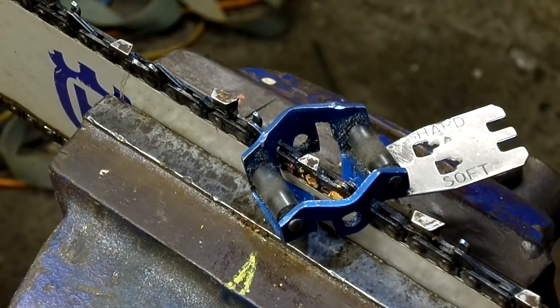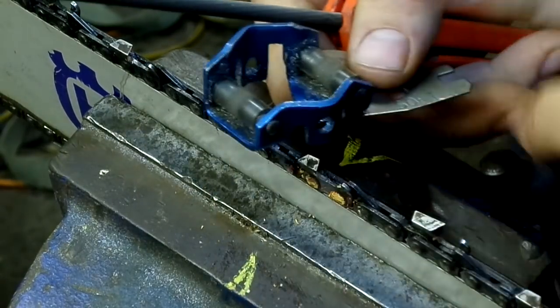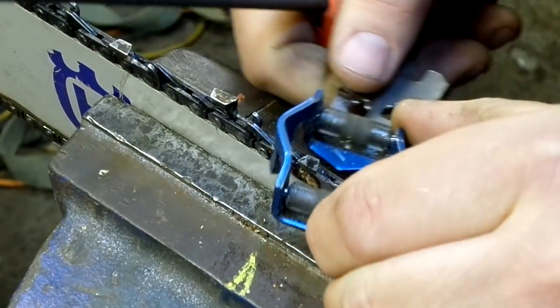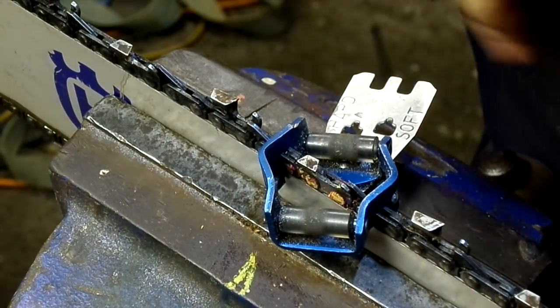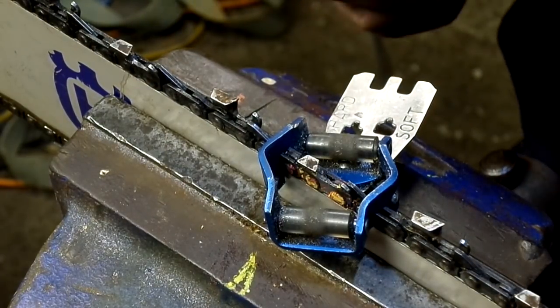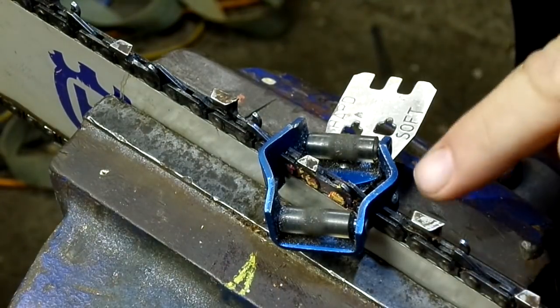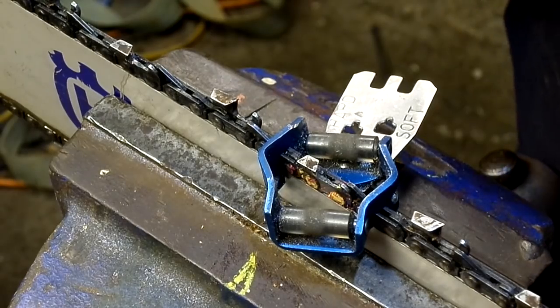It's a 3/8 bar chain. So I'll show you what I'll do — that way is the tip. Because these were damaged, you've got to take the worst ones back first, as far as they go, get past the damage. And everything else will have to come back to the lowest ones. That's the only problem — I've got to take a lot off the other side just to match this side, because one side got hit more than the other.